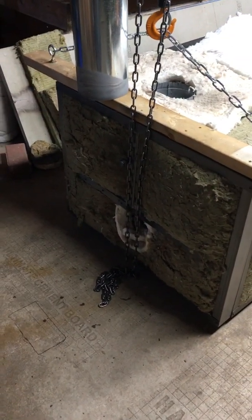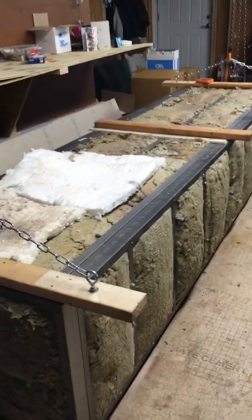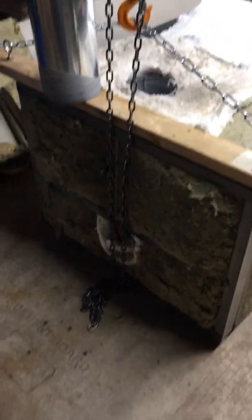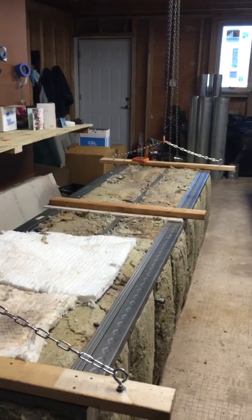So this is a good size oven for one source of heat that's external. There's no burner that goes down and then heats evenly down there. So what was happening was we're getting uneven heat inside this big oven. We tried to solve some of those issues with the flame tube to distribute the hot air down across that length. And even doing that, we still have hot spots.